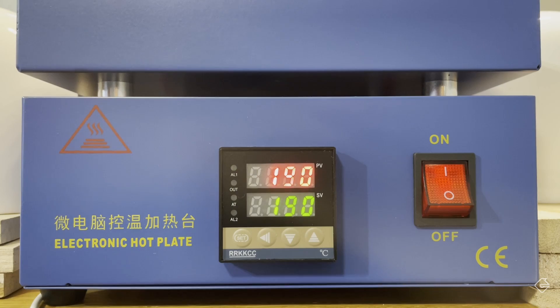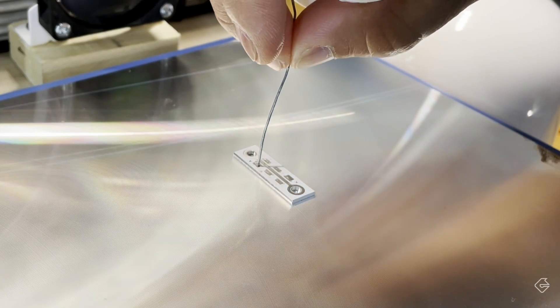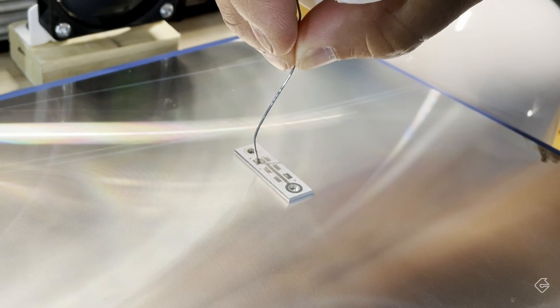After realizing my mistake, I let the thing cool down completely, set it back to 190, and let it stabilize. This time, to help the process along, I applied some liquid flux to the surface — and as you can see, I ended up burning the tips of my brush a little, so probably not the best idea to do that when it's hot. The flux appeared to evaporate, but the solder still didn't melt. So this time, rather than applying the flux directly to a hot PCB, I pre-applied the flux to the cold PCB and then placed it on the hot plate. But I still couldn't get the solder to melt.